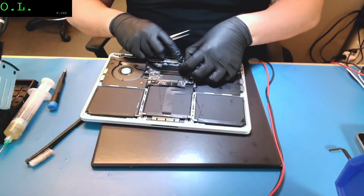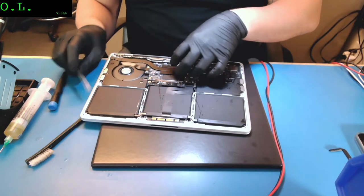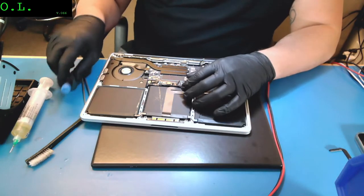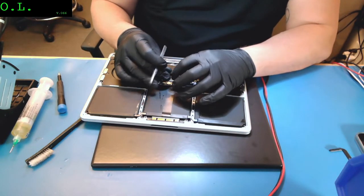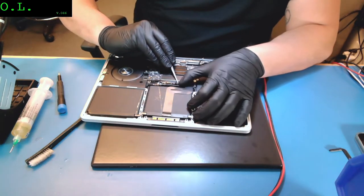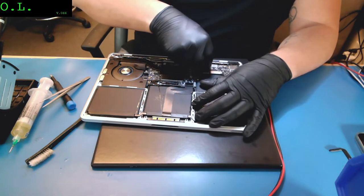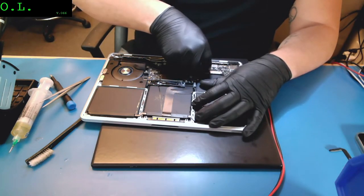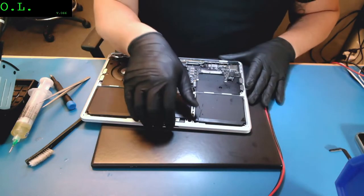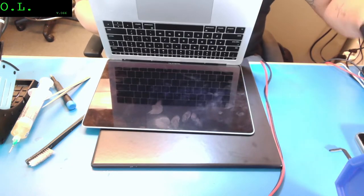There are more tests to do when it's like that. You can connect it to an external terminal. You try to see if caps lock is working. You apply a little bit of heat to the sensors to see the fan start and CPU activity. But at this point, because I knew there was water damage on the computer, I didn't spend more time testing it. I just knew that we needed to fix the issues on the logic board and then retest the computer. Now, if the computer has the same behavior, then I will do those tests I'm talking about.